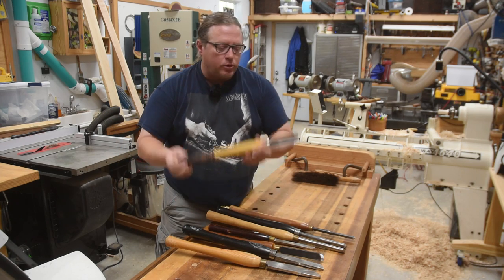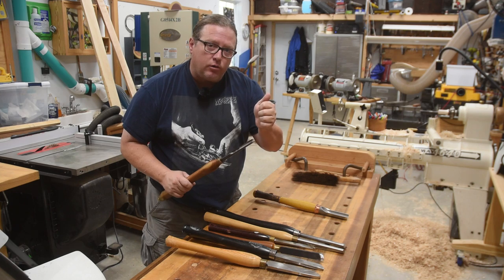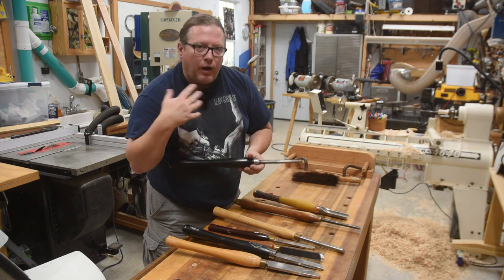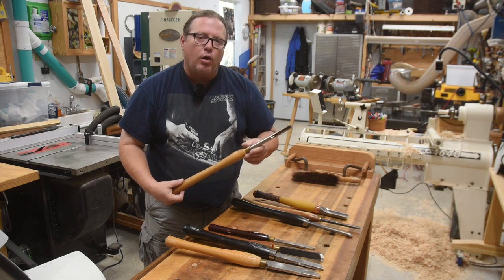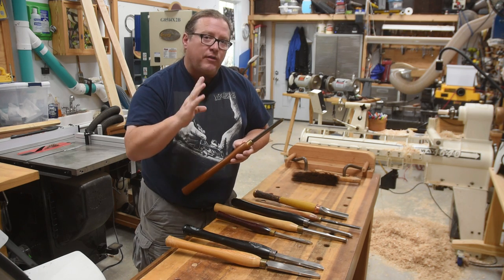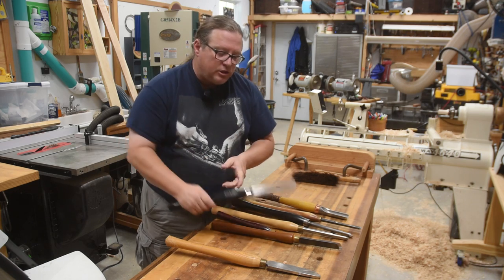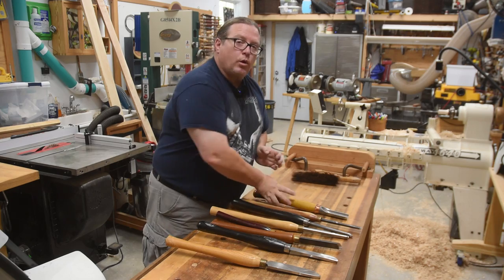Here are the tools I'm going to discuss sharpening today. We'll start with a spindle roughing gouge, then a spindle gouge with a more difficult fingernail grind, then two bowl gouges — one at what they now call a 40-40 grind (some call it Ellsworth, swept back, or Irish), and one conventional bowl gouge, often called a bottom feeder. Then a parting tool, a skew done in the harder method with both a straight and curved section popularized by Alan Lacer, and finally two bowl scrapers — one conventional, one with a negative rake.